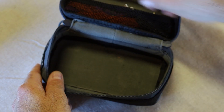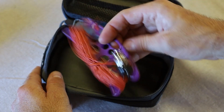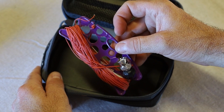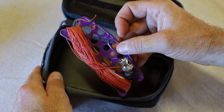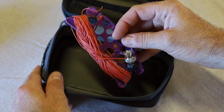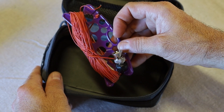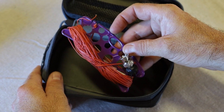The antenna is an end-fed random wire. The KX2 has a built-in tuner, so we've got a significant advantage in being able to operate a random wire antenna for multiple bands and keep the system really simple. This antenna is super light — check out one of my other videos, linked in the description below, to see how to build one.